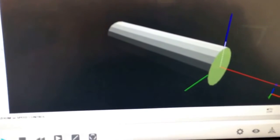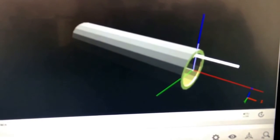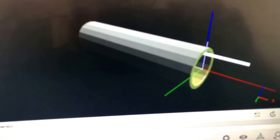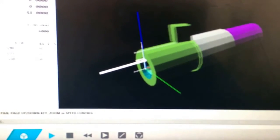It starts doing operation: face. That's a drill. This is cutting threads — lots of passes for cutting threads. Actually the first thing in there was cutting the interior arc, and then this is doing threads. Lots of threads. OD roughing — OD, that's outside diameter — finish. This is now the secondary spindle. So that was facing, then a little bit of boring bar work, then some threading.